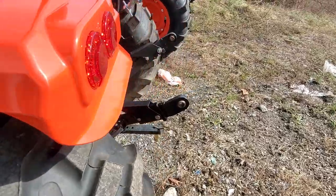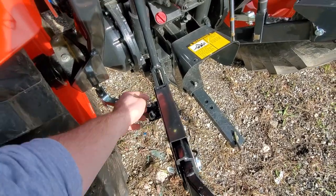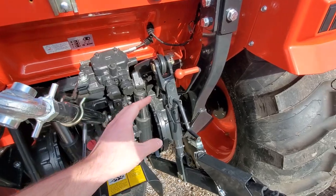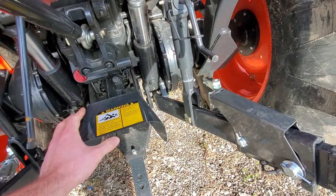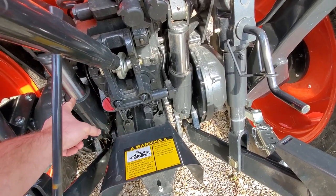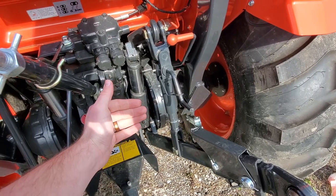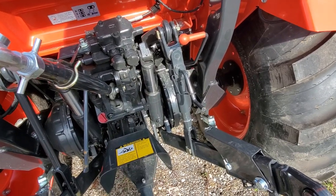Everything on the back is deluxe. You've got your extendable links on an NX, pin-type check chains, a standard set of rear remotes with the option to add another — and that's regardless of open station or cab. You've got a bevel gear style leveler as opposed to a turnbuckle. And then external lift cylinders as opposed to an internal valve — they're a little more serviceable, dimensionally a little closer to the implement, give you a little more lift back here, and they're greasable. That's considered a higher dollar feature.